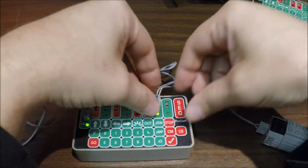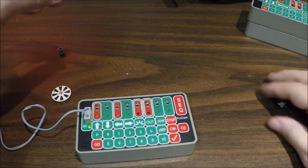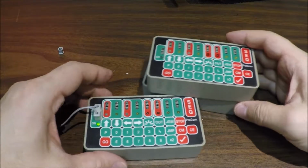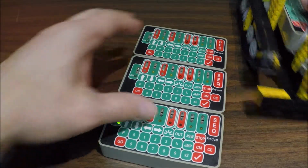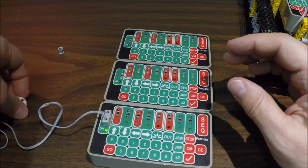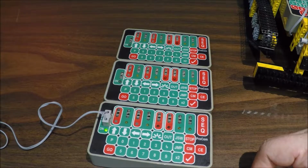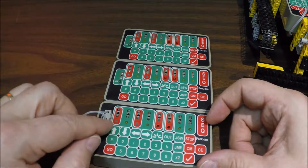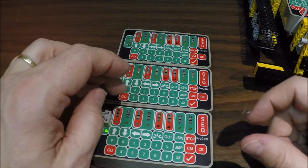The one thing I actually did find out just by playing with these things is I have 4 of them from the Facebook buy and sell. I already got one in here. And possibly not only was the voltage, input voltage, causing me consternation trying to figure out how these things work, because originally I started off with 4.5 volts, and it turns out that I needed 9 as an input. But some of these ports are actually dead, and I'll demonstrate that.